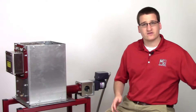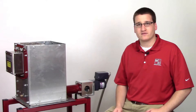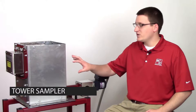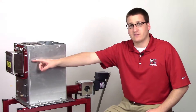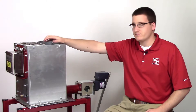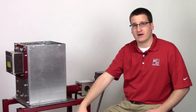The infeed sensor will be located on the roof of a tower or the hopper of a profile, and the discharge will be mounted on a sampler dependent on the machine. Here, we can see a tower discharge sampler. You'll see the sensor is mounted on the back there, and grain would be passing down from the top. It'll slowly move by the fin of your sensor, and then leave out the bottom of the dryer.